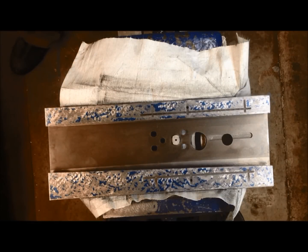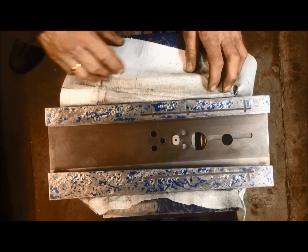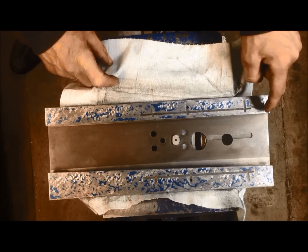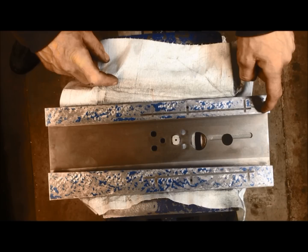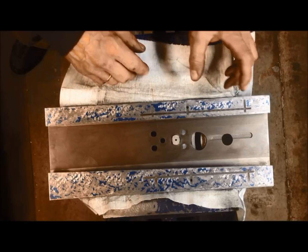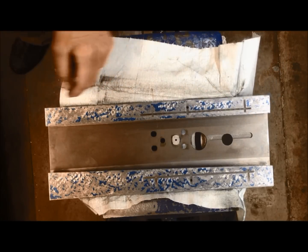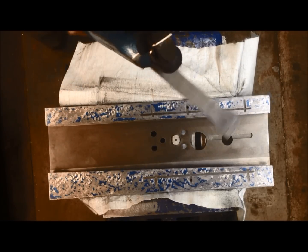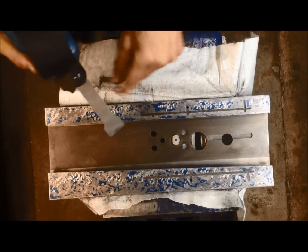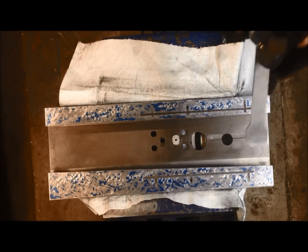So I blued it up again with a little bit more blue on the plate. Let's get a better view. I should have prolonged the basic or preliminary scraping sequence with circles or heavy crosses, sets, long stroke. I did, however, try to short circuit the process a little bit, so I could show you at least I've got some progress here.